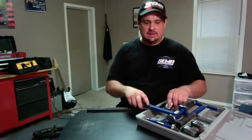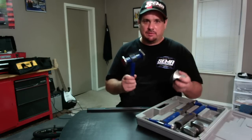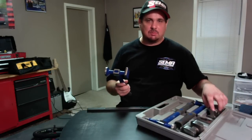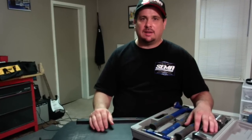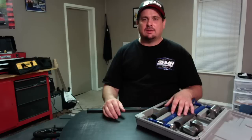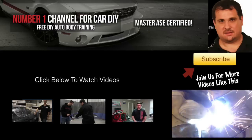You have to be careful — anytime you hammer on dolly, you're stretching that metal. So you need to be careful with that. You may have to use your shrinking hammer, and if you stretch it too much you may even have to use a heat shrinking method. This was just a quick overview of hammers and dollies. I hope you enjoyed this video. If you want more information, there's a link down in the description. If you like this video, be sure and give us a thumbs up, share it with your friends, watch some of our other videos, and subscribe. Thanks for watching and we'll see you in the next video.